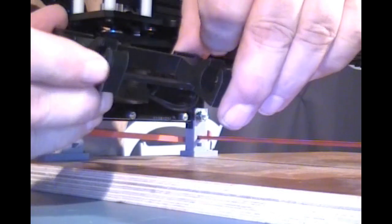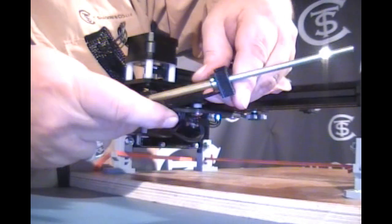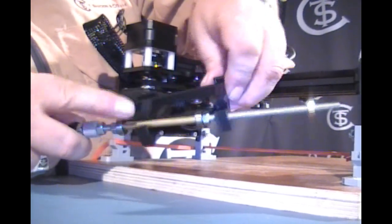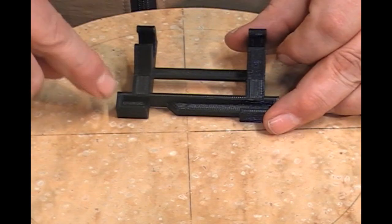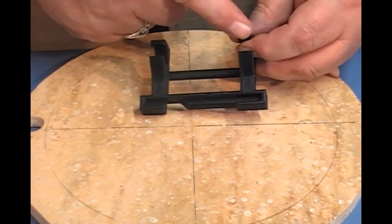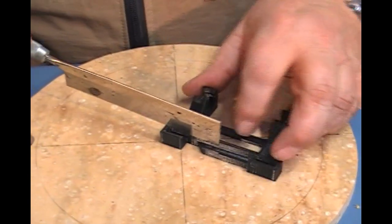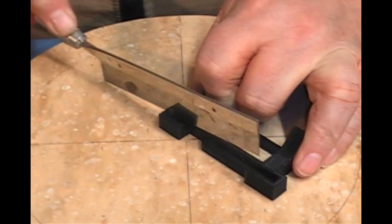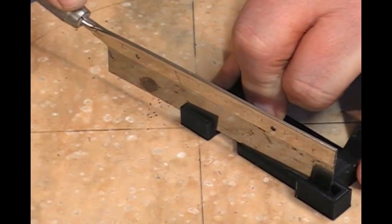What we're going to do is take the end. If you look in here where the bearings go, one side has a shoulder — that's so the bearing indexes against that. The shoulder side we do not want to mess with. It's the other end we're going to work on. Opposite of the end with the shoulder, we're going to cut that stop out. Take a razor saw, hold it flush against the bottom of the groove, and just simply cut back and forth, then against the top of the groove.